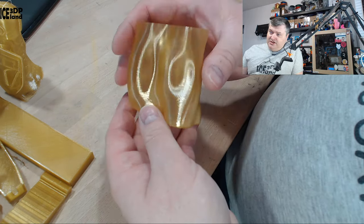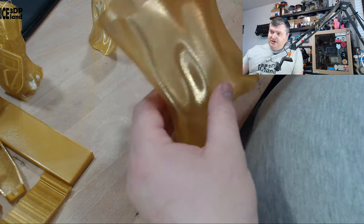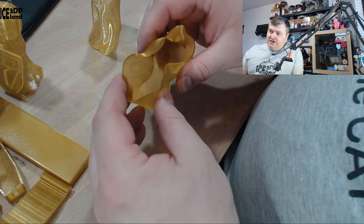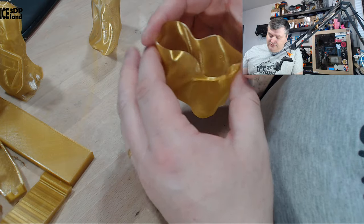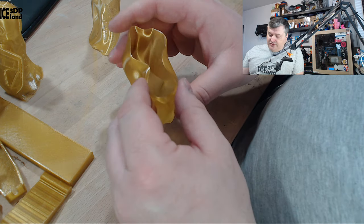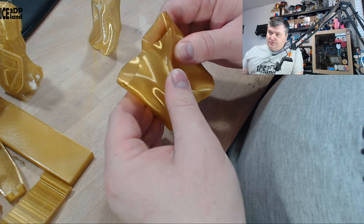Then I did a vase print — a model I created — and it came out excellent. You can see how shiny it is and it flexes quite nicely. I also did a bigger one that came out excellent, though it cracked a little when I squeezed it hard, but it's a really thin print. Then I did another vase with a thicker extrusion width of 1mm — this one is pretty rigid and really strong. I was following an old Teli3D video and tried it out in Slic3r Prusa Edition, finding the settings to do it. Even in vase mode, it's really really tough.